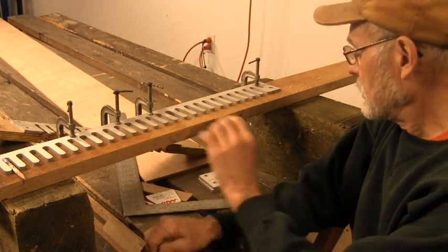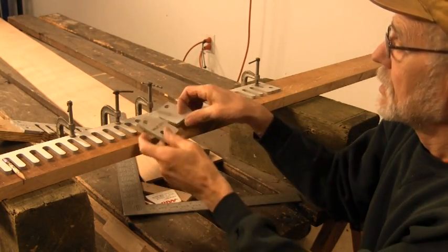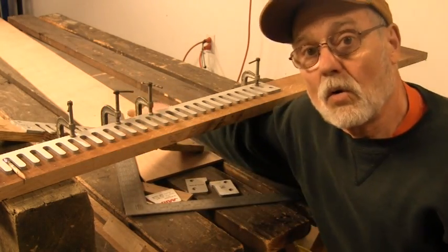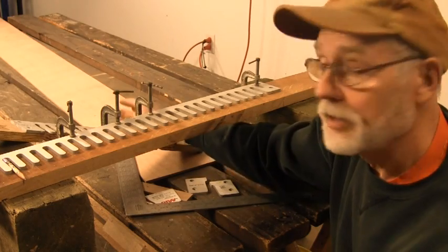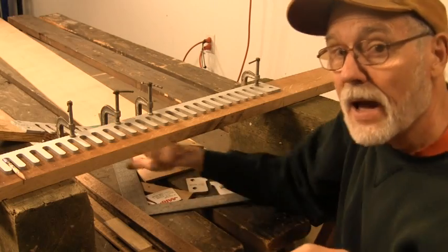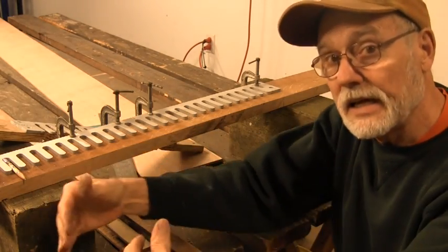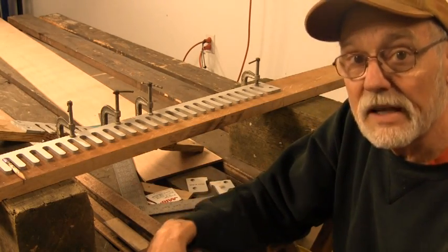But I've chopped the ends off of 2 of them and got them joined up. Now I got some 1/4 inch plywood over here. I'm going to cut it in half and then epoxy together and then put these on, so that'll give me a 1/2 inch back, fairly wide, so that'll give me some clamping area, so that the routers won't get in the way of clamps on either end.